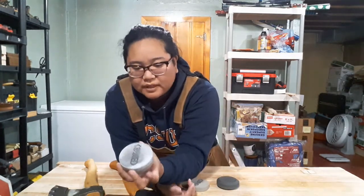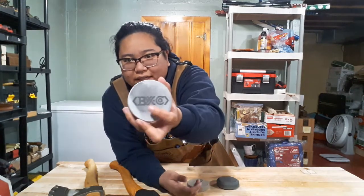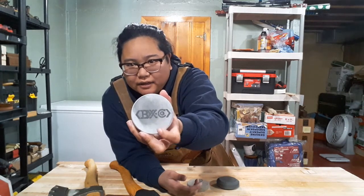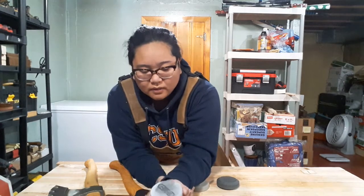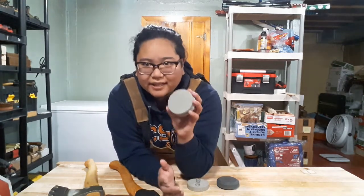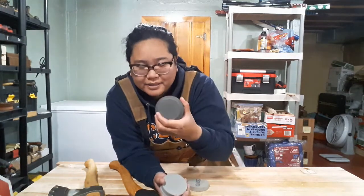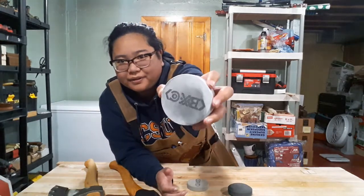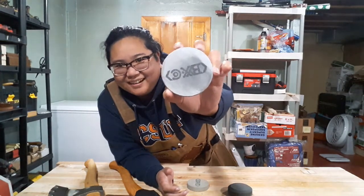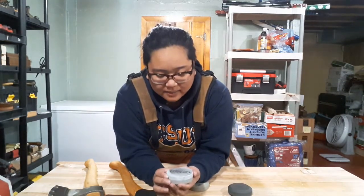This other one is the Baronex combo stone. You'll see they replace the Baronex brand with names like Whiskey River Trading Company — Arctic Fox is basically just the Baronex brand rebranded. What you get is something slightly finer than the Lansky puck, even on the coarse side. The fine side is actually very fine — as you can tell after I used it, all that black bit used to be very white. It got dark and full of metal shavings fairly fast, which I like.